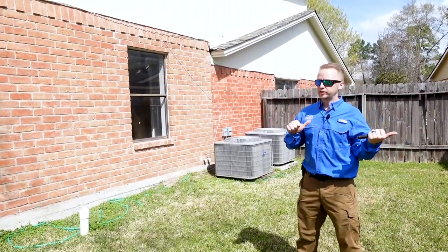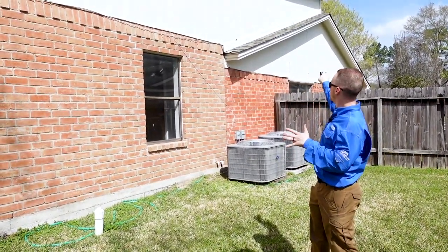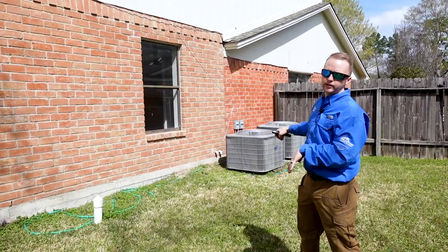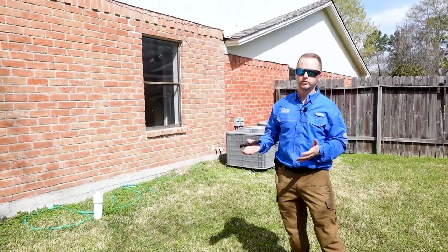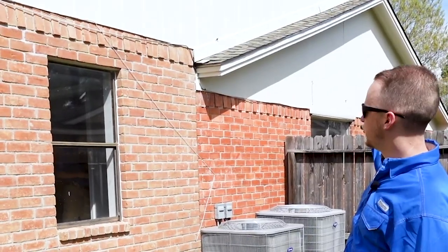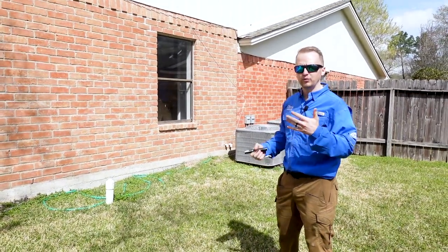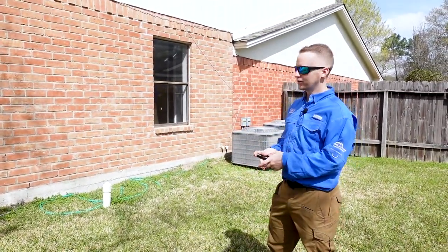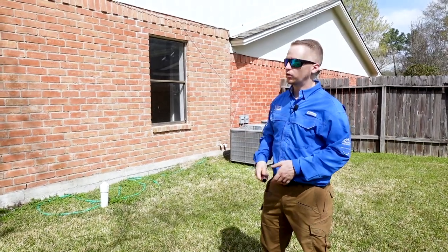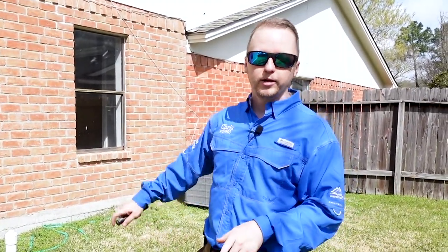On the wide pass of the back of the structure, there's significant pitting on this roof slope — hard to see from walking it, but prominent from the ground. Following the drain line down from the HVAC unit, it's pointed upward, which means it won't drain properly. It should also be positioned in front of a window or door so you'd know if it starts leaking. I predict we're going to find something wrong when we get in the attic.